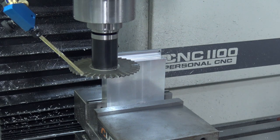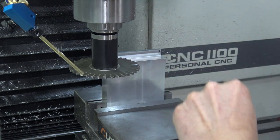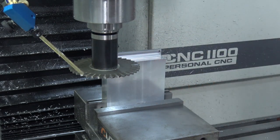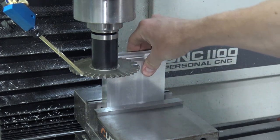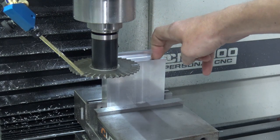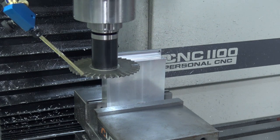We still are going to have some heat build up from this cut, and I don't understand why. I understood when we had the old style cutter that didn't have the side cutting, because as this part gets some heat in it, it might pinch down. And that cutter, I believe, per Tom Lipton's video, they are relieved from outside toward the ID. But here, because we're cutting all the way along here, and then this is massively relieved, it's kind of funny to me that it generates so much heat. May also shorten the life of the tool. Here, I don't really care. For what we charge for this job shop job, buying one of these cutters for 20 bucks is really not a big deal.